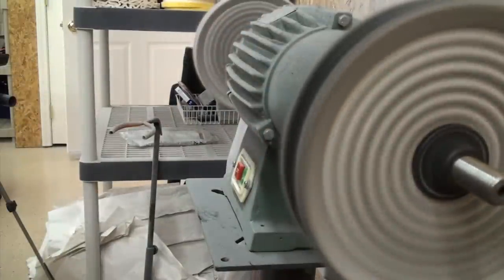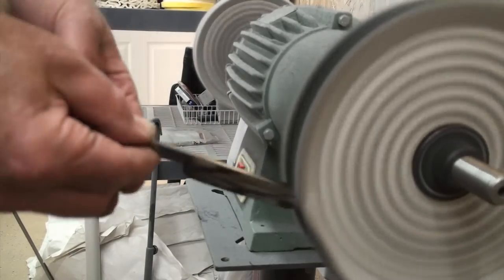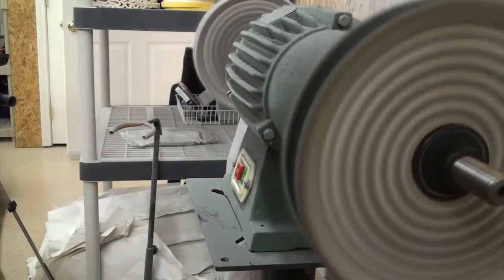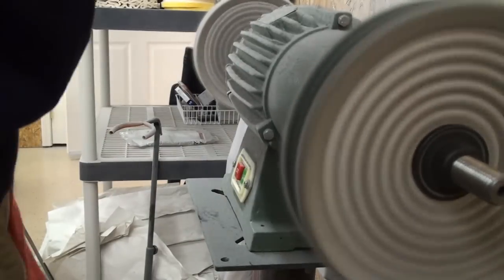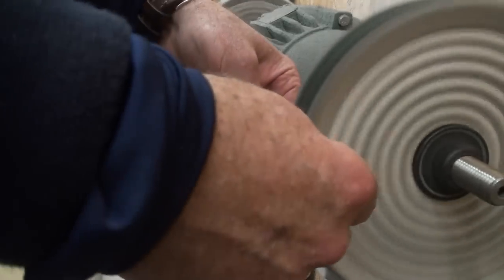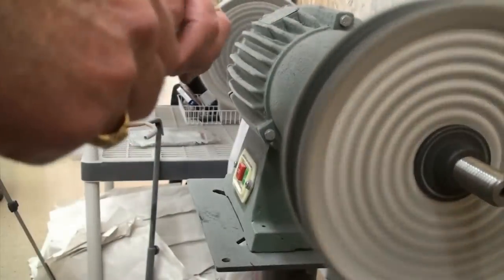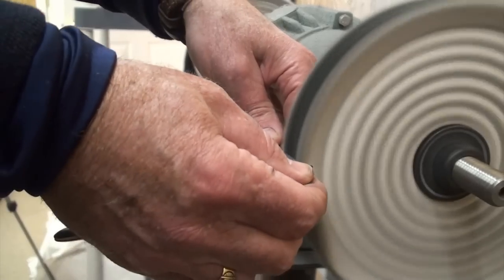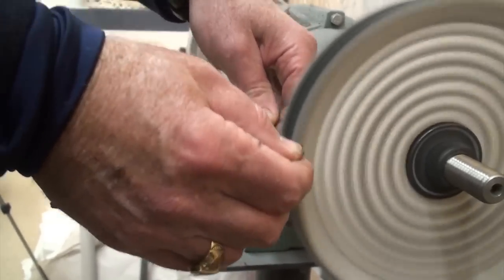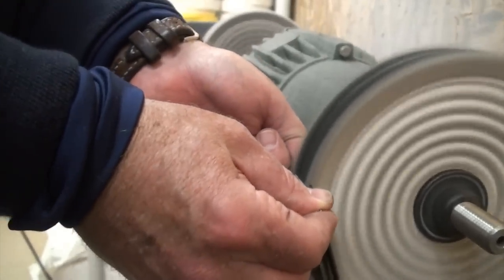Firm contact is good. I can see where my blade is cleaning up. See why the tarnish is good versus the other? I'm going to take the one with the spider rust — or what looks like spider rust to me — and we'll find out as soon as we get it on this. But you can see what I'm doing here. It's all pretty deliberate. I've done enough of these where I know how I want to attack which parts of the blade on the wheel so that I don't have it grab and jerk it out of my hand.